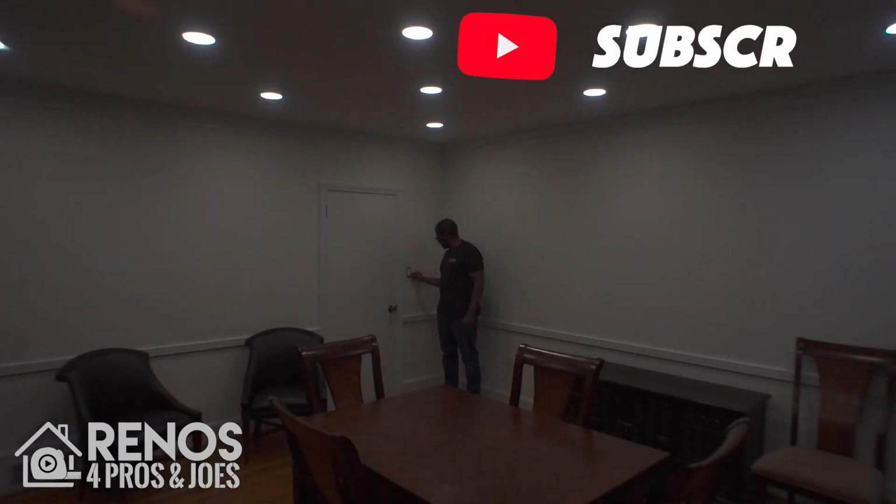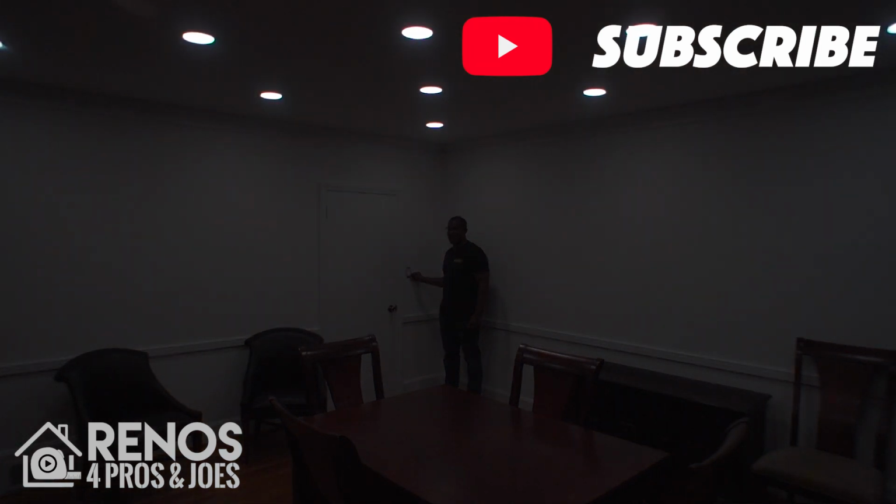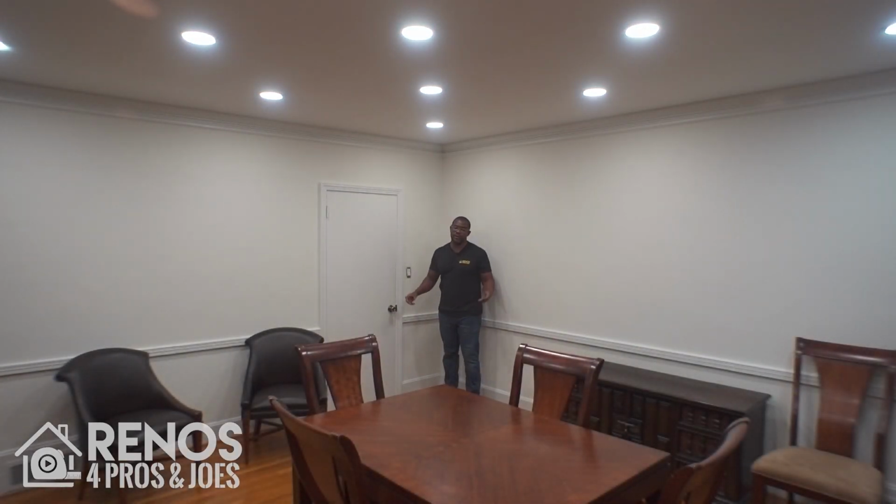Before we do that. All right, so same setting, different vantage point. You can see different fixtures in the ceiling, but same overall feel. It's a very blue or much bluer feeling than the feeling that we had in here initially when we started out at the 2700K color temperature. And let's gradually bring it up. We're now a little bit better than 25%. 25% is probably right around in here. Then we're gonna bring it on up to 50%, which is right around in here.